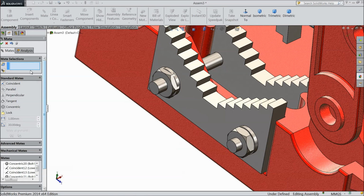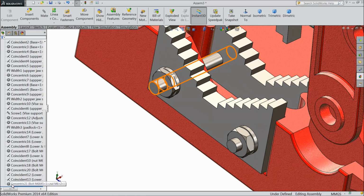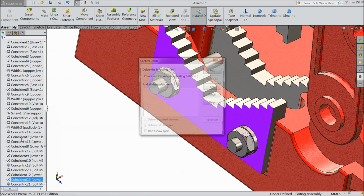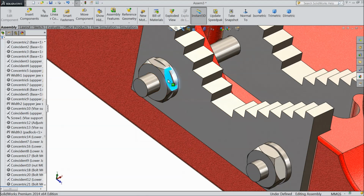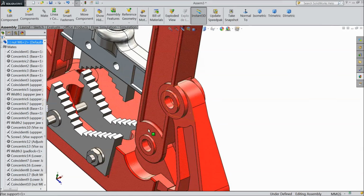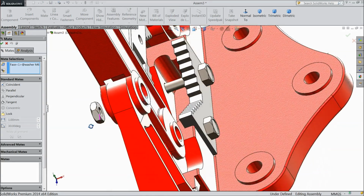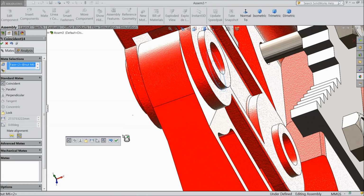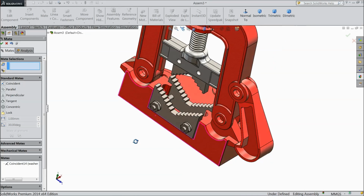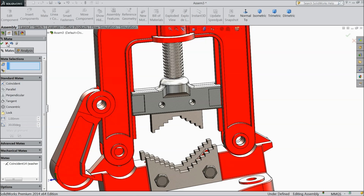Okay. Now delete this last relation, second last relation. Second last this one. Now drag it out. Select face and select washer face. Sorry, mat, face and washer face. Okay. So these two nuts and bolt we fixed. Now the same as we can fix on the top face also.